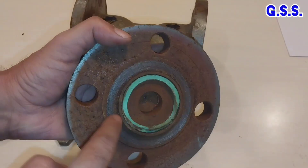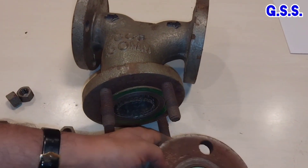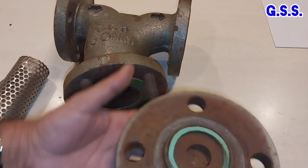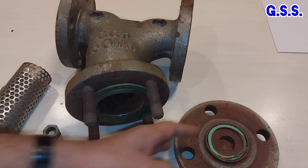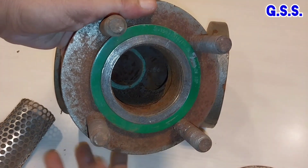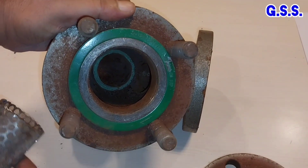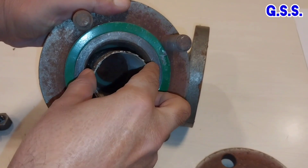This is the raised groove and this is the rubber ring. Over this rubber ring, the cylinder sits like this. This is actually not a blind flange — this is called a cover. This is the spiral wound gasket joint between the body and cover, and on the inside there is also a rubber seat or rubber ring. On that ring, the top portion of the cylinder is pressed or rests.